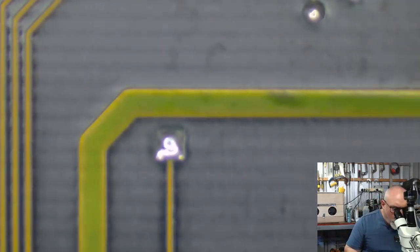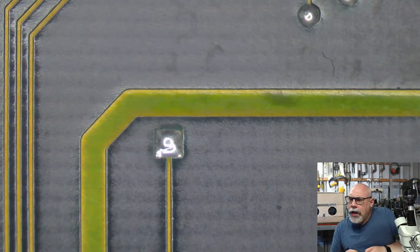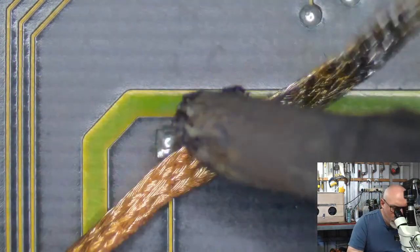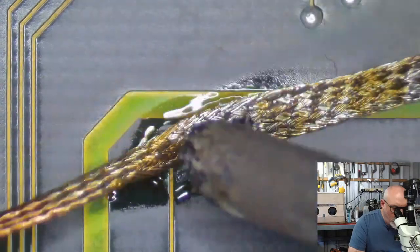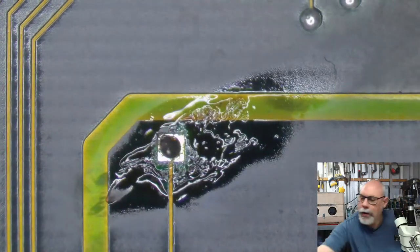You have to refocus here. Let me just check on the loads of thermal requirements. Non-leaded takes a lot of heat. Yes, that's right. That's one of the main reasons why I don't like using lead-free solder, because of the fact that it requires more heat to melt. Don't like it.